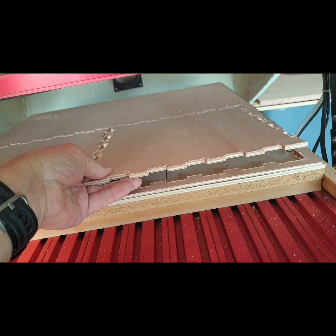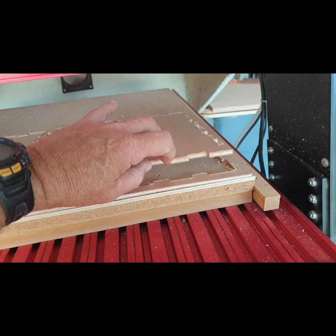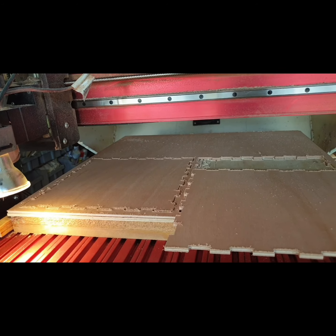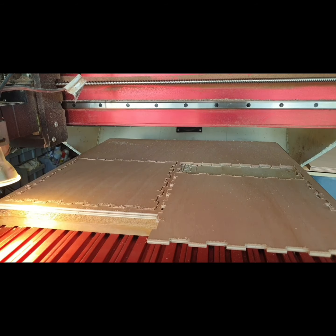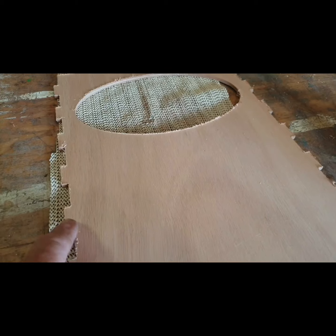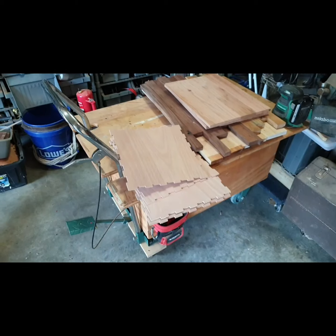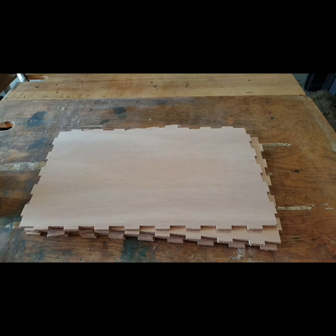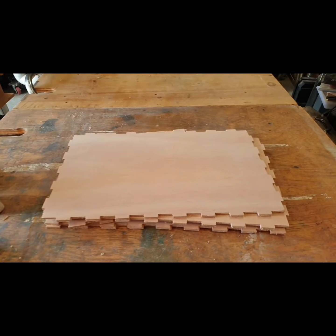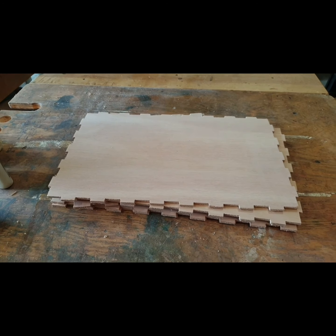I cut out my two pieces and didn't put a tack in there, but the parts are big enough that they don't move around much on that last cut. For little parts, definitely put some pins in it. I'll use that other side for the next piece. I'll take the sander — I think it's got 180-grit on it — go over it real quick to cut all the little fuzzies off. That'll make the joints easy to put together. Got two box pieces sanded and ready to go — I did eight cuts total — laying them out for a dry fit.